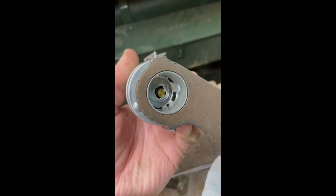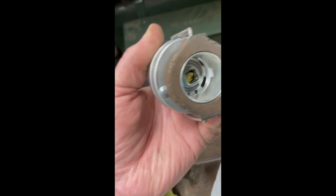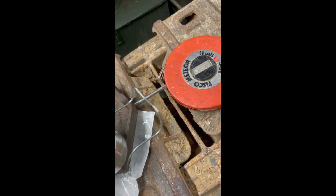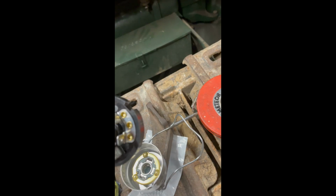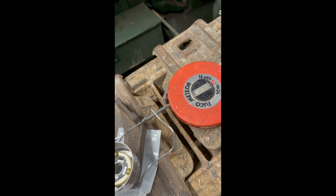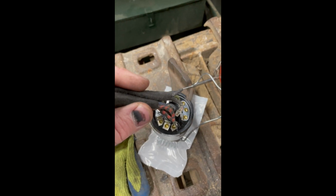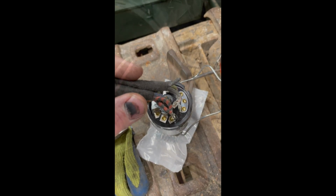And there's the little square drive. That's a little square drive that drives the switch mechanism, which is a 5/16 square, so I need to put that on the end of the rod, which is going to come from the dashboard and give you positions. So the way it works at the moment, unfortunately I can't get it to do the off, charge and headlights. You've got charge, headlights, off, and then charge only. So it's a bit of a different sequence, but who's going to know? So let me fit this all together and I'll do the next bit.